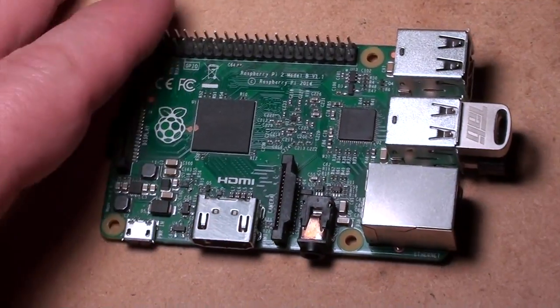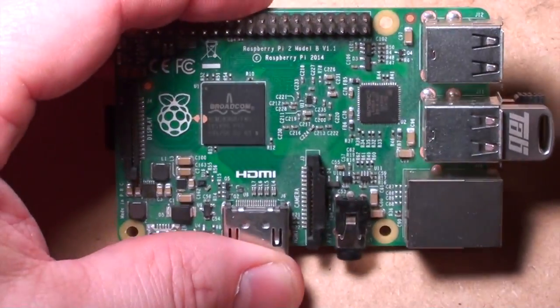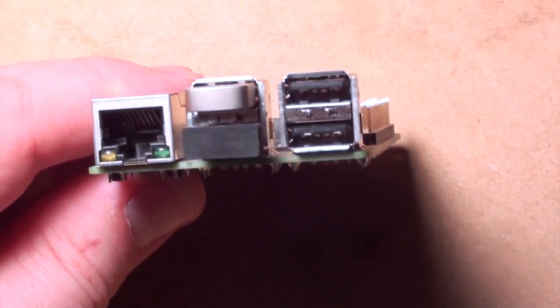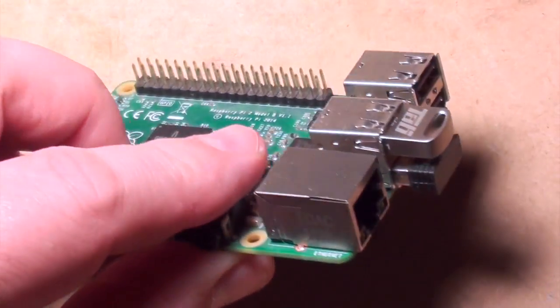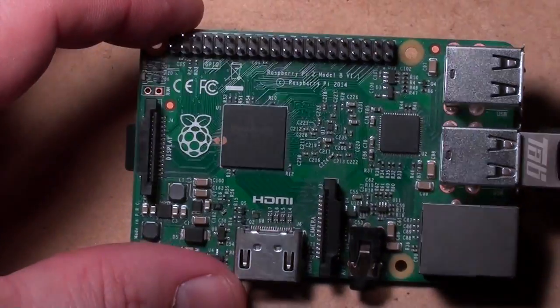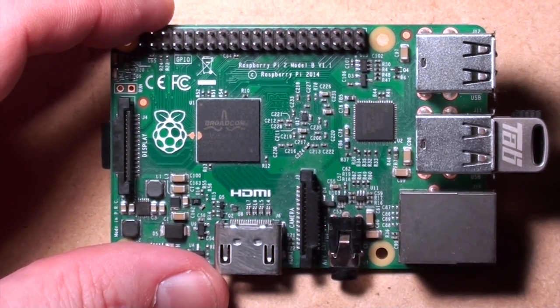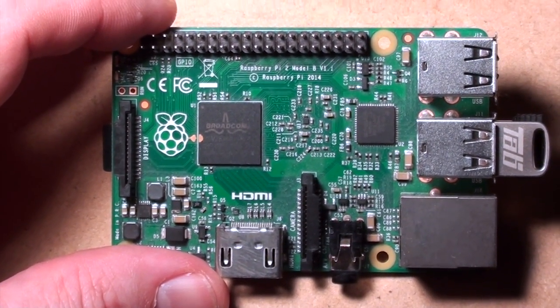Creating sequences can be time consuming, but if you're just trying to get started, you can create a sequence within a few minutes. Once you have a sequence, you connect your computer to the controller and you play the sequence, which controls your lights. Now, many people use a Raspberry Pi, a single board computer, to play their sequences automatically. This avoids tying up your main computer while your display is running through the holidays. There's free software called Falcon Player. It turns the Pi into a player. I'll go into more detail in a future episode.